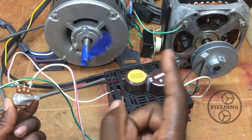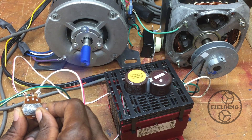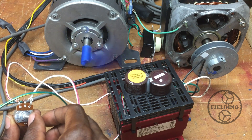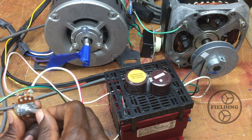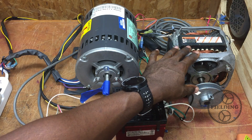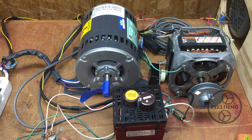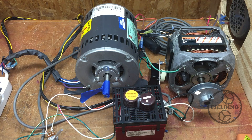This is a potentiometer giving feedback to the VFD. This is a four-horsepower three-phase motor, so I don't want to turn it up too high. A VFD is the only proper way to vary the speed of an induction motor. Trying to run a single-phase motor — especially a capacitor-start type — with a VFD can cause problems: issues with the centrifugal switch, the starter winding kicking back on. There are several reasons why VFDs for single-phase induction motors are rarely made.